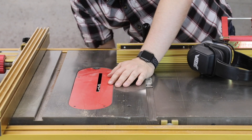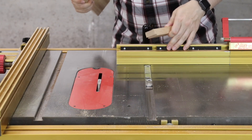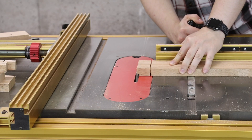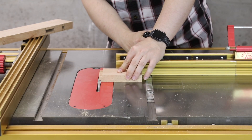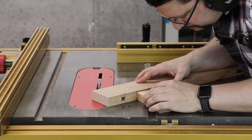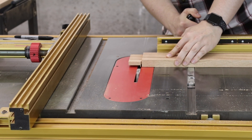I used a box joint blade instead of a dado blade because it gives a much nicer surface on my tenons. I cut slowly, bringing up the height for just the one side, which was the part that aligns the vertical piece with the back. Once I had that cut, I flipped my piece over and tried my test piece out, and that setting was just a little bit too deep, so I had to bring the blade down and then work my way back up. I did not get the fit I wanted at the table saw.